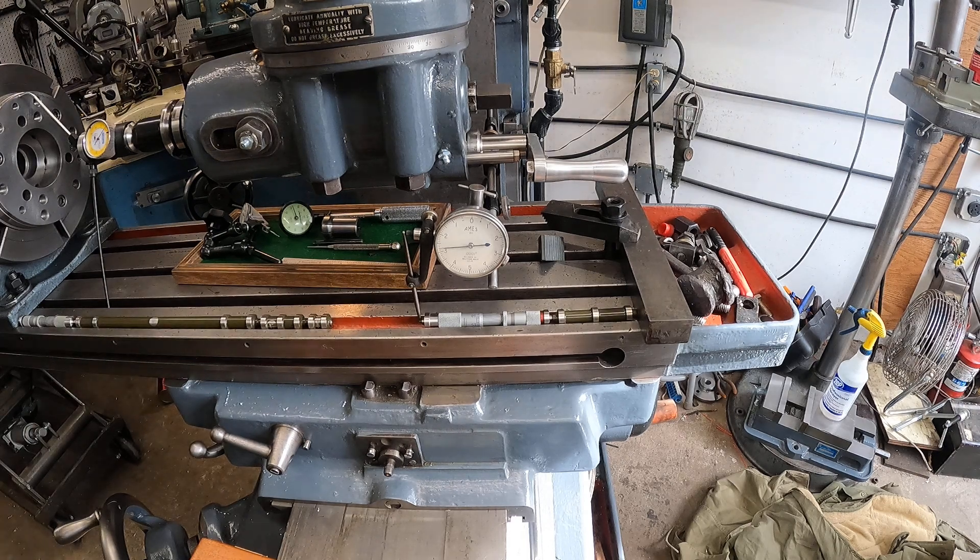It's not really cranking at five, is it? I'm going to back it up again and go by that indicator at this point. Now I've stopped — you see that? It keeps creeping. What that is called is stick-slip, and there are a bunch of reasons for that happening.